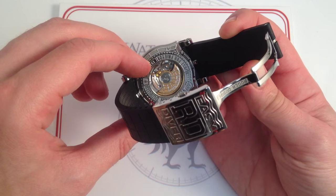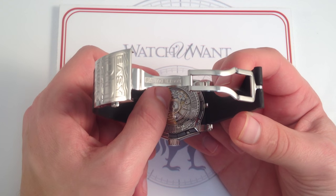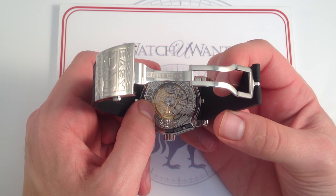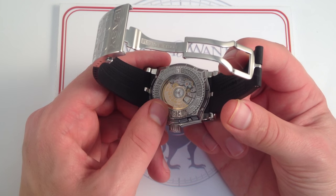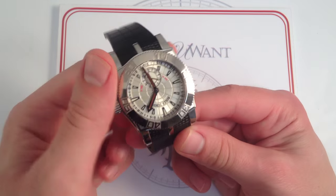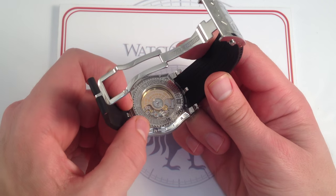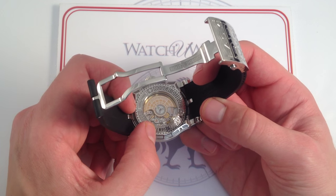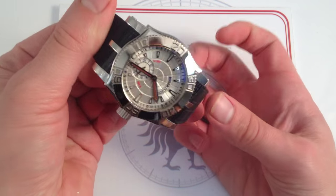It gives up nothing to the Vacherons or the F.P. Journes of Geneva. But in addition to traditional finishing and architecture elements like separate cocks for the escapement and fourth wheels, it also features modern technology, including unidirectional winding for high efficiency, and ceramic rotor bearings for the winding rotor itself — unlubricated. They promise improved efficiency but also reduced long-term maintenance needs. The movement does hack: when you pull the crown, it will stop the balance. The swan's neck regulator anchors the index of the balance and prevents it from being displaced by shock, altering timing during active diving, jogging, or beach activities — however unlikely in a timepiece of this caliber.